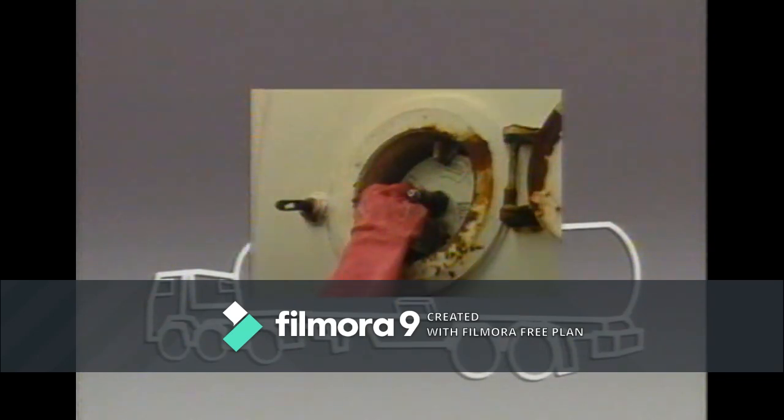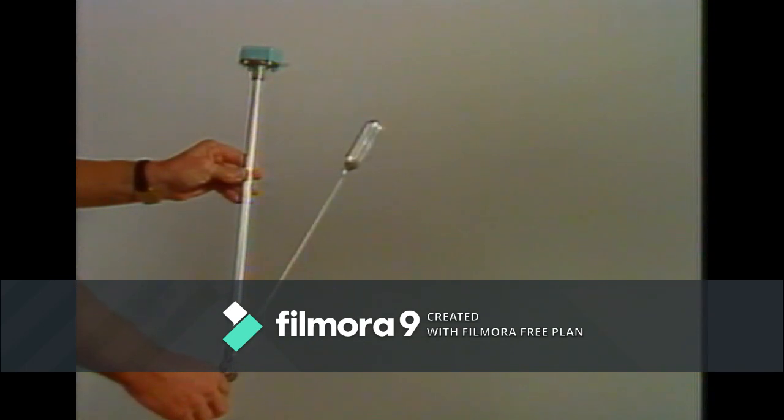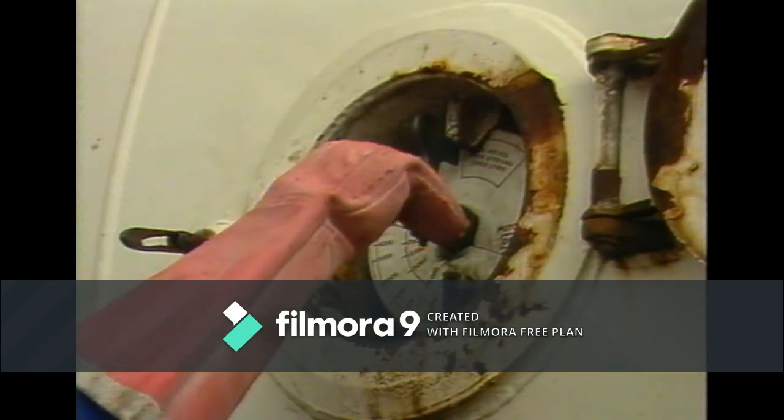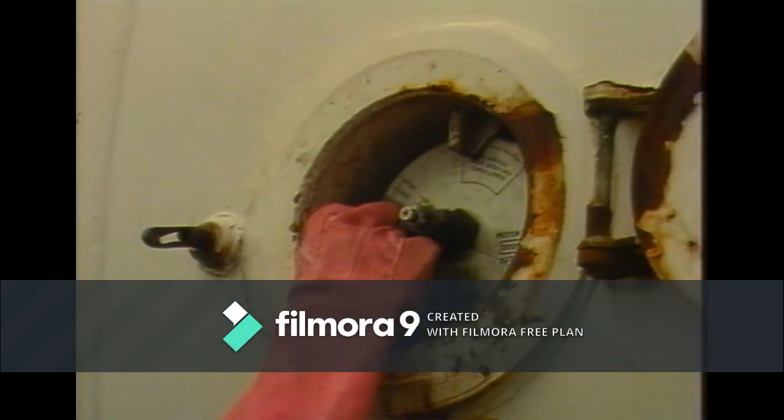A liquid level gauge is placed on the horizontal center line of the tank. This can be a simple float-operated gauge or a roto gauge. The roto gauge consists of a tube inside the tank which can be turned upwards or downwards. The liquid level is found when LPG liquid escapes from the open bleed valve.